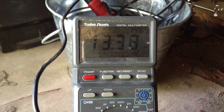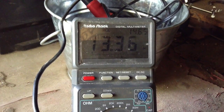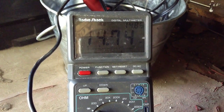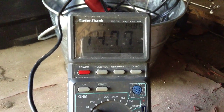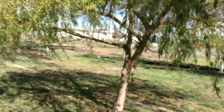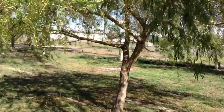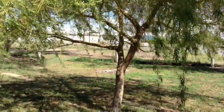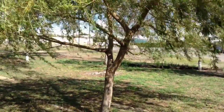Charging voltage max I've hit is 14.65, so the batteries are keeping the voltage clamped down pretty decent. Got a gust of wind out there — almost hit 15 volts. So this is definitely showing me that the generator is putting out too high of a voltage when we catch a good wind. The way it's set up now, I would probably hurt the batteries if that was in a real decent wind — it would push them way too high because I don't have any sort of a dump load. So I'm going to get everything disassembled and rewire the coil to six sets.